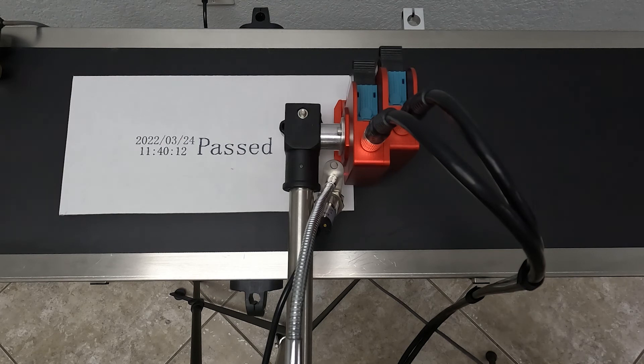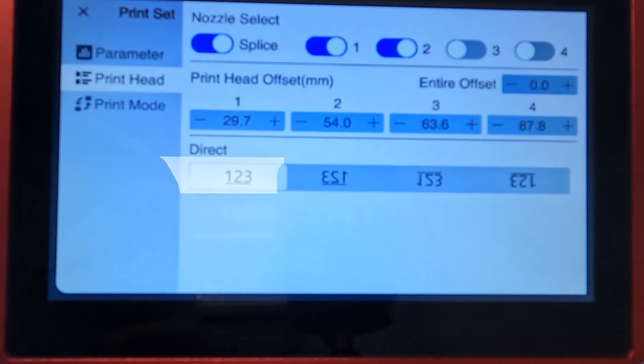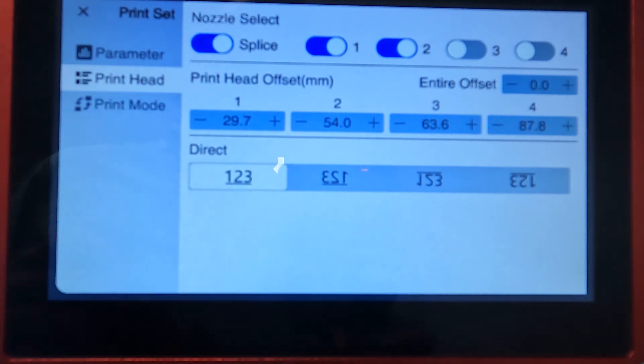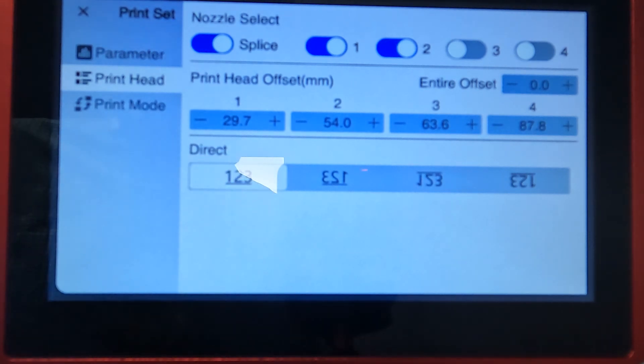This is the process for stitching your print heads — it's quite simple, and you're just going to repeat this process with every other print head. It's important that you do each print head one at a time to avoid having to go back and make changes, because adjusting print head three may have an unexpected effect on print head two. Get those print heads lined up one at a time and everything should go smoothly, assuming you have the correct speed. If you don't have the accurate speed set or you're not using an encoder, this process can be time consuming and essentially trial and error.